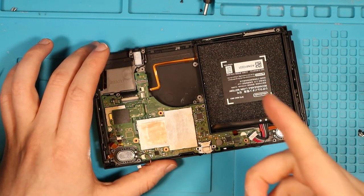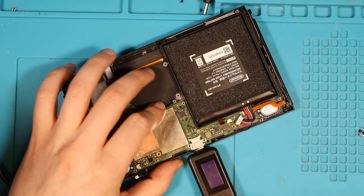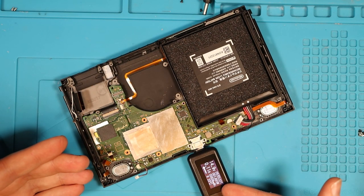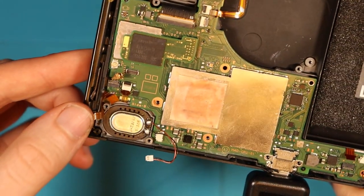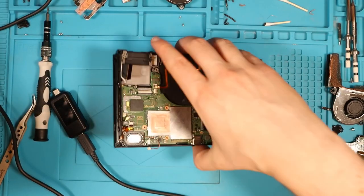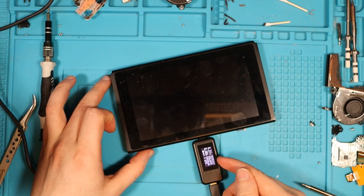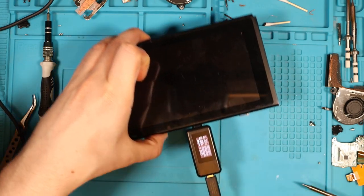After this, I'm going to replace the P13 chip on the back of the board. Let's see — do we get anything different, even just a slight bit of difference? 0.06... 0.7... 0.11 amps! This is different to what we had before — before we had 0.00. The backlight's on — I can see the backlight! I put a screw or two in and flip it over. Then it reads 0.00 again... then 0.07... there is simply no way that has caused it to work. I'm really nervous.